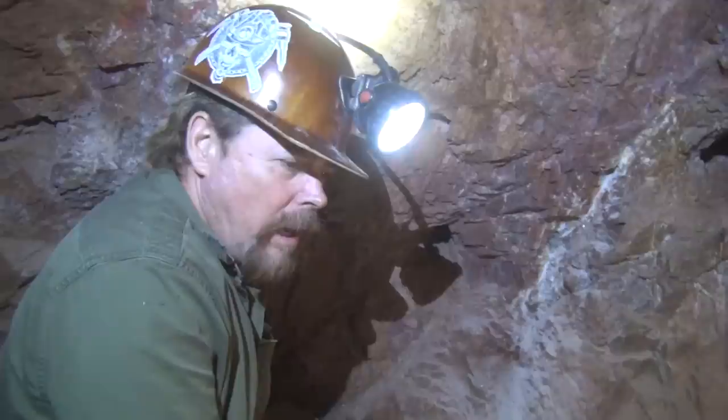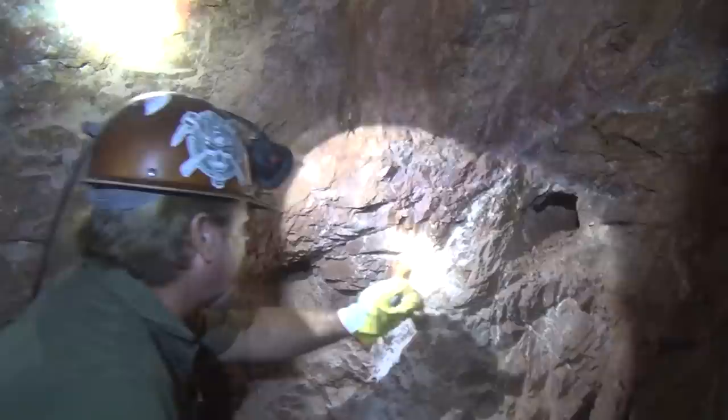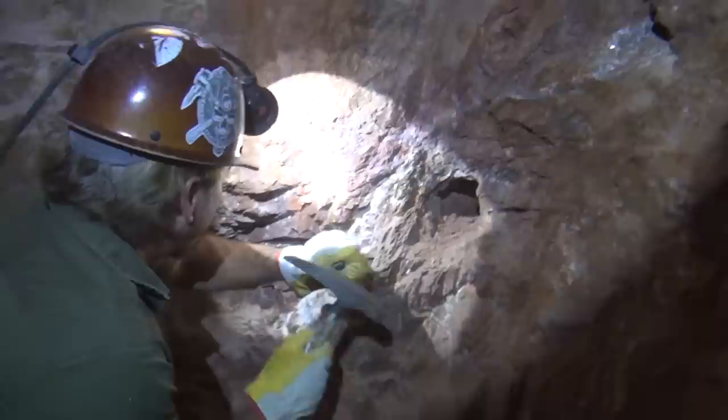I like to roast between 400 to 600, but some people add silica to their sulfides to keep them from sticking to the cast iron. You roast for about 30 to 45 minutes. Your material is going to turn to a deep earthy brown, red, or black. And that's when you know you're done. You dump it in water, fracture it, and then you can use gravity separation, like a sluice box or something to get it out, or gold pan it.